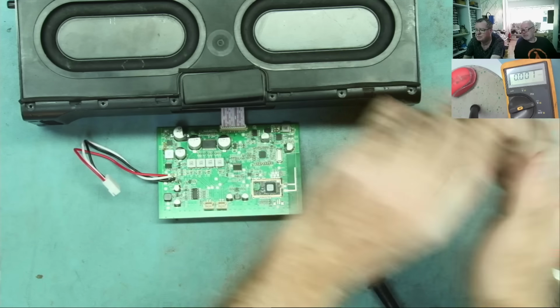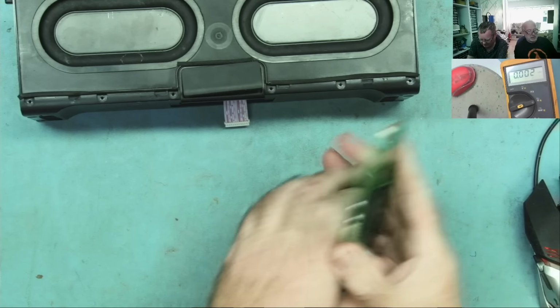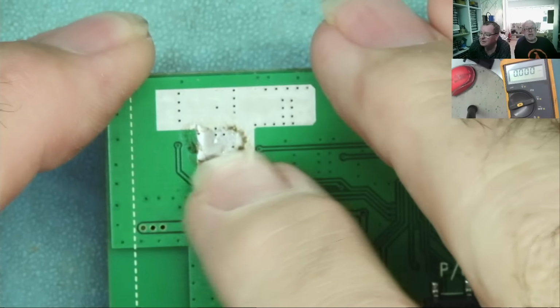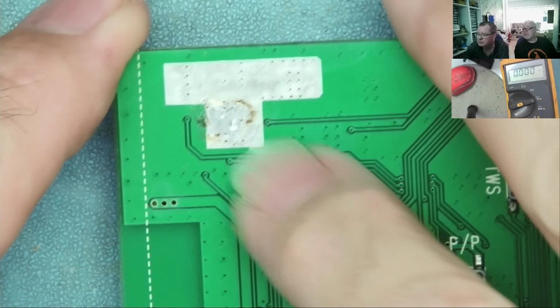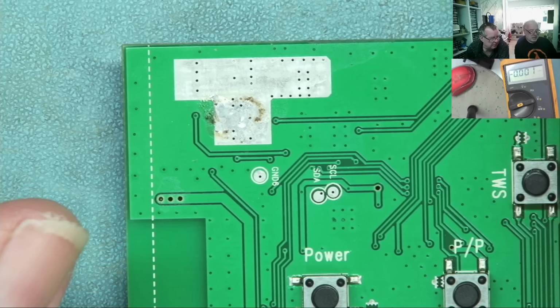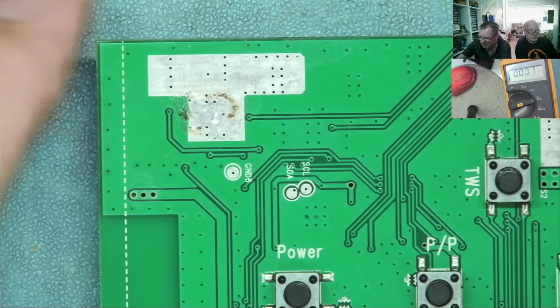You know what? I'd expect, because I soldered that thing. Oh man, I think you're right. This is what you told me, what we were talking about before. So under here, this is soldered to the actual chip. That's how I soldered to the pad. I put some solder in here. How do we prove if we've got a connection? Well, let me see if I can get something from the data sheet here. I'm going to just resolder that.